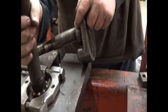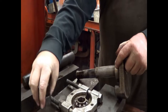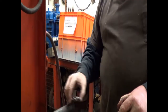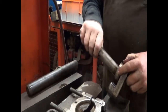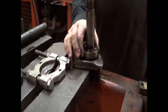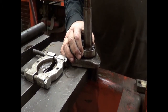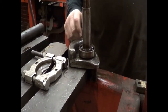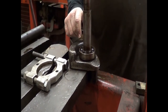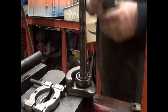I caught it. Got it. We need that spacer. I don't think we can reuse this. Here's the issue: this machine was making terrible noise, and you can see that roller bearing is wiped out. I'm not even going to try to get a bearing splitter or puller on that — I know I can't do it. We're going to mount it in the vise and cut that bearing off.